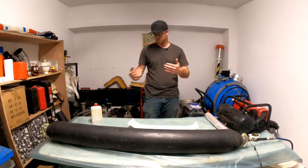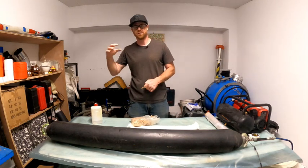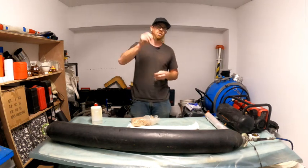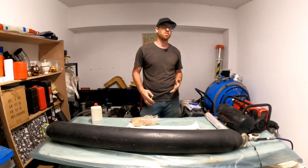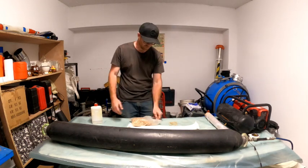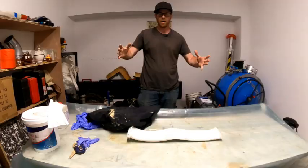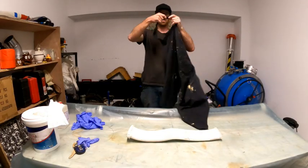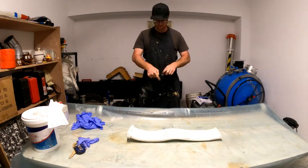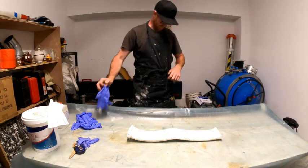We're going to measure out our liner and the resin to pour, then wrap the packer and get it done. I don't like using ties for the smaller diameter pipe — for a three-by-four, there's a slight chance they won't pop right — so I'm going to use rubber bands for the four-inch part and ties for the six-inch part. I've never had a problem with that method. Also, make sure you wear a protective apron and extra gloves — it's really important when doing pipe patching so you don't get silicate all over you.